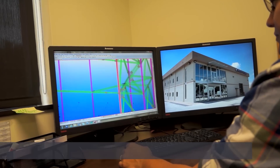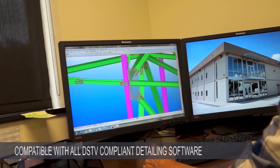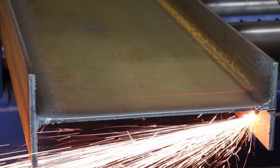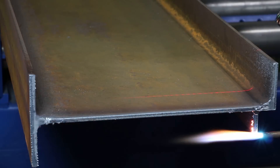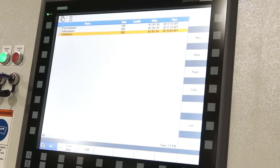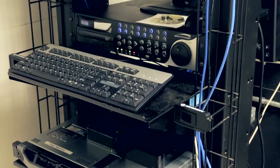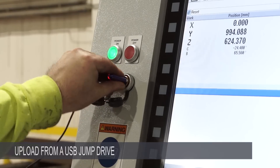The Ocean Liberator is compatible with all DSTV compliant detailing software packages, such as Tekla Structures, SDS2, BOCAD, and many more, as well as management software such as Strumis, FabSuite, and others, and will import projects directly into the machine for processing. Files are easily imported by a network cable or by inserting a USB jump drive.